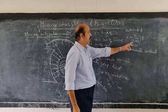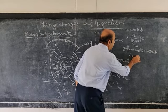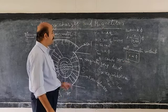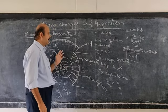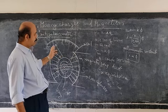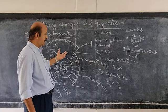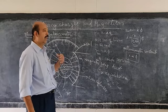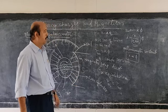Therefore, once you know this quantity, then current can be easily calculated. So, the current in the galvanometer is proportional to the deflection of the coil. Hence, you can calibrate the scale on the galvanometer over which this needle moves suitably, so that it may give directly the reading of the current.